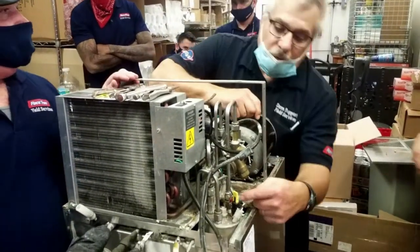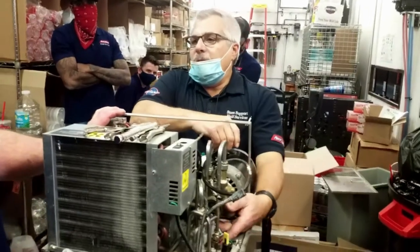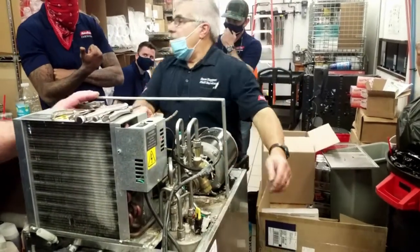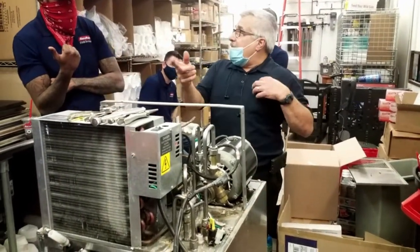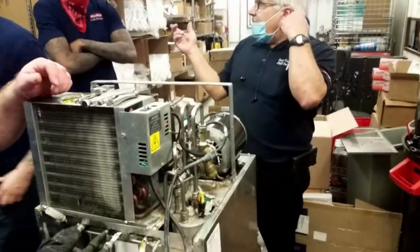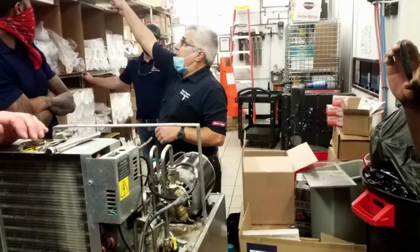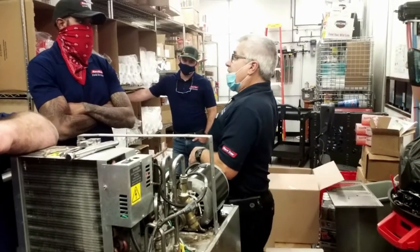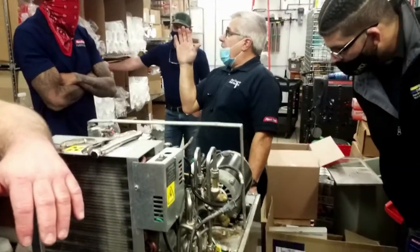Right. So the CO2 usually isn't an issue. Where is CO2 going to go? Yeah, that's why it's only a little single check valve. The water. It can also cause a leak from the actual CO2. Well, the CO2 tank will start icing up. Oh, you can't find it? Well, the way to tell is to use your little pinch-off tube and go up to the CO2 line above the machine. Pinch it off. Turn that valve off. If the pressure drops, okay, it's not the machine. Now go behind the fountain. Keep checking until you turn the valve off and the CO2 stays. That's where it's at.